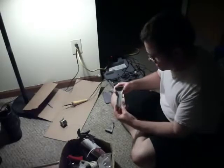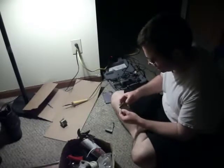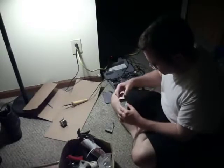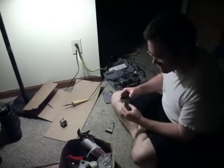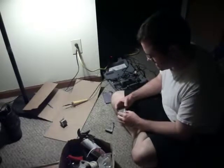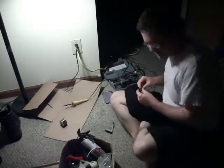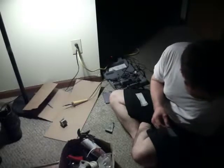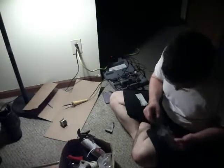What you do is take a ribbon cable — this is a floppy drive cable, part of IDE, integrated drive electronics. A hard drive cable will be a little bit wider, 40 pins total; this one is 34, giving you 17 rows in length. A hard drive cable gives you 20 in length. A SCSI cable might have more pins and let you fit more lights. These are great because the connector forms a type of light socket while having all your wiring inside.